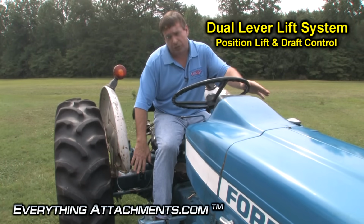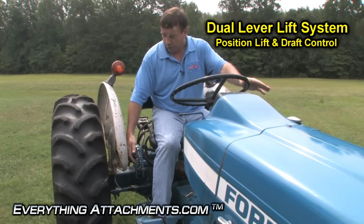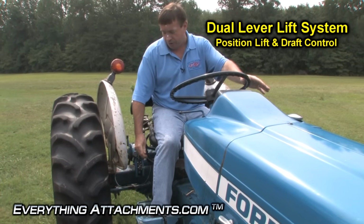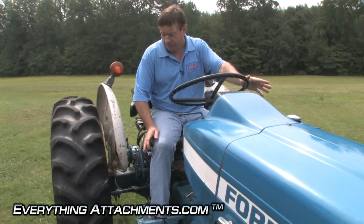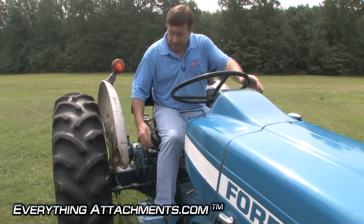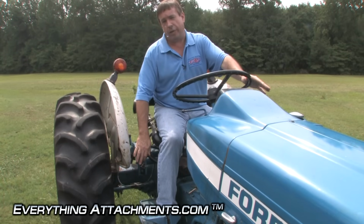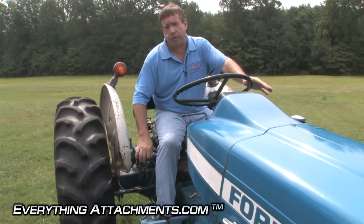But this is the best type of system that was really ever invented, and that's a dual system where you have control of your position and your sensitivity of your draft. On an older style tractor from 53 to 65, you would have a single lever, and then you would have a lever right here you switch, and it's either draft control or position. It's an either or lift. So it still has draft, it still has position, they just won't work together.